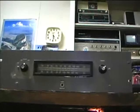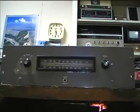I replaced all the capacitors in it and the amplifier portion is working okay, but the tuner is not. I'm using an external tuner to feed in some audio, so I'm going to take the chassis out now and check it over and see where I don't have voltage. I saw a burned resistor in there, so I think that may be the problem.